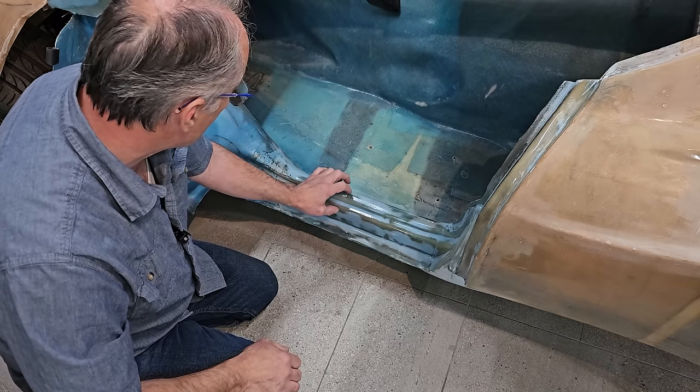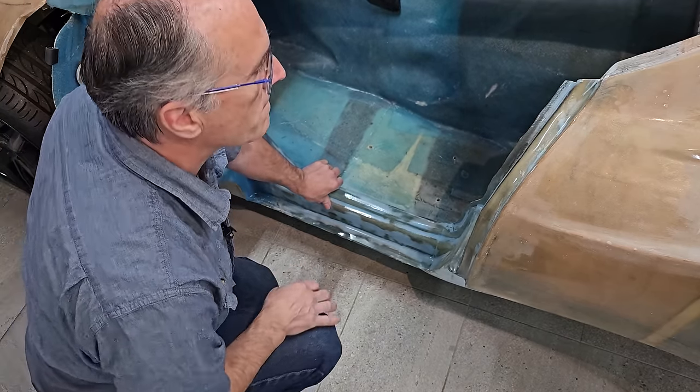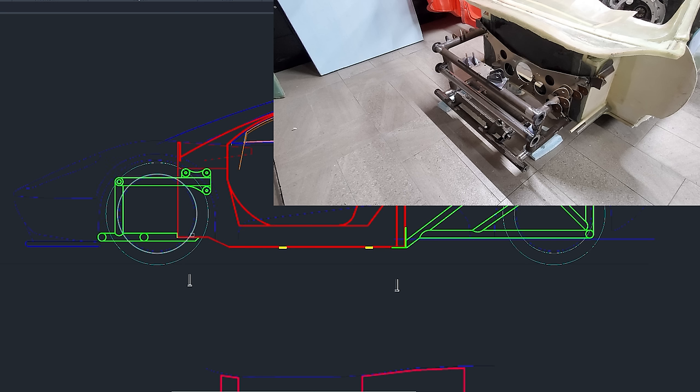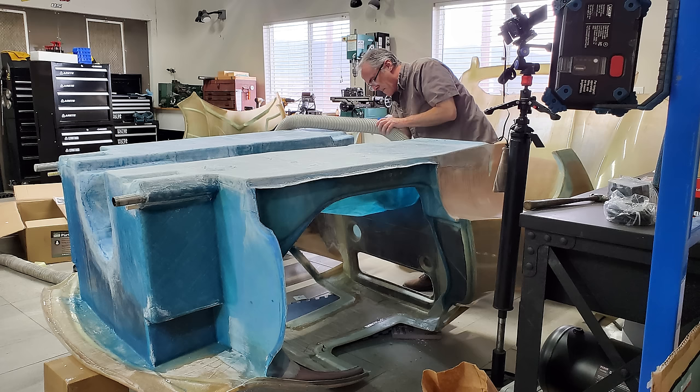There's about four layers of unidirectional fiber with foam between them - almost a solid piece when you count all the foam. One thing I've done to increase the tub design is to design the subframe so it attaches at points without any hinge action, spreading loads out to more places on the tub. You can see three attachment points on the back - the rear has a little more moment arm with the wheel being further back. The front subframe also attaches from the bottom and from the side, so no hinge points. This avoids focused loads from suspension, braking, and acceleration. That's three or four things influencing the design of my fiberglass tub.